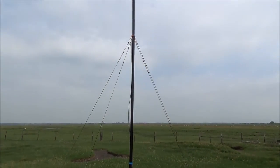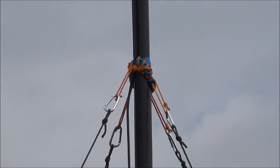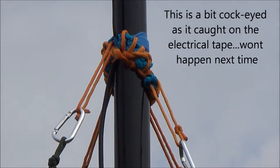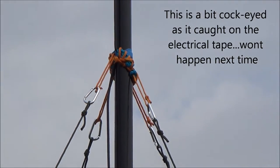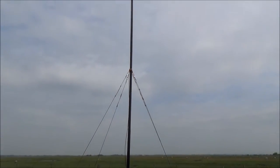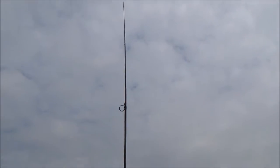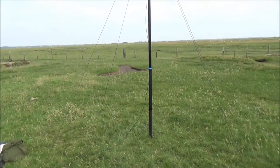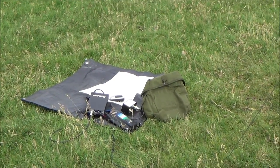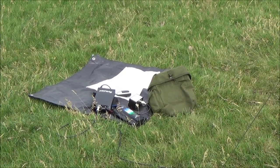There's the 10 metre pole set up. I've had to create a new collar for the 10 metre pole - I've just done a cobra stitch round a rubber grommet and attached some short pieces of paracord and four carabiners to my existing guy lines. There's the balun right up there, all the way to the top. I've just SWR'd it and I've got the SWR down to 1.6 on channel 1, 1.6 on channel 40, 1.5 on channel 20, and 1.5 on channel 32. That's a lot better than what I was getting before.